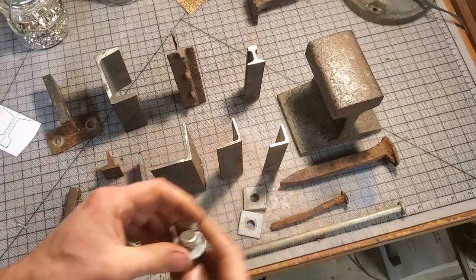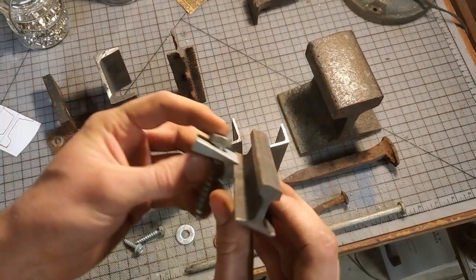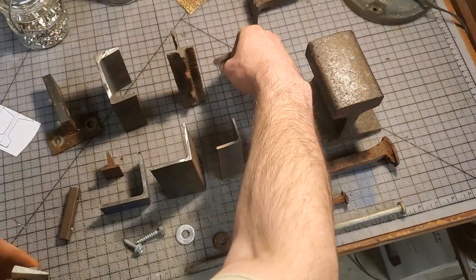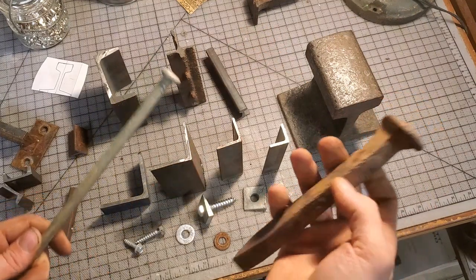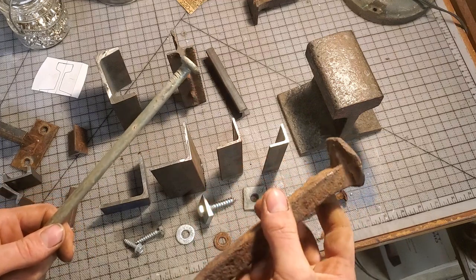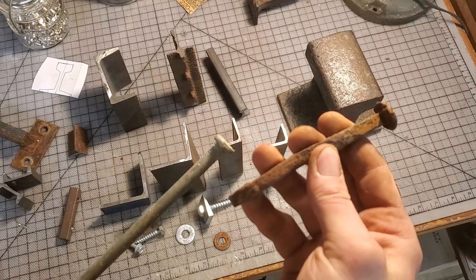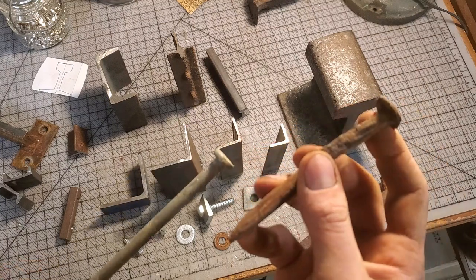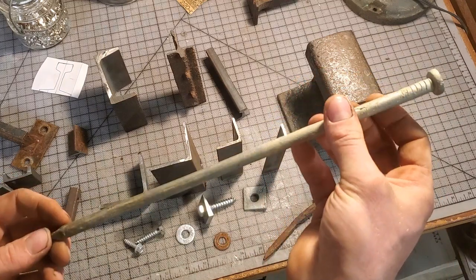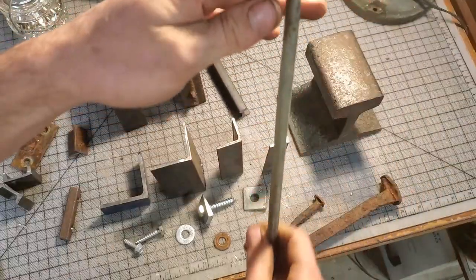On the topic of fasteners, anything from about 3/16 through quarter to 3/8 lag bolt are my current favorites. I'm using 3/8. This is about a 2½-inch lag screw — generally longer is better. Those can be used in combination with round washers or these nice tapered beam washers, which help take up the tapered part of the foot on regular rail. Regular railroad spikes won't be much use here unless you're using very large actual railway sleepers, as they'll probably split anything smaller. Smaller spikes are also not easy to come across — they are available from rail suppliers but you'll have to pay for them. Landscape spikes are more available but much too long for most applications, though they could help hold ties to the ground by going through the tie and into the soil.